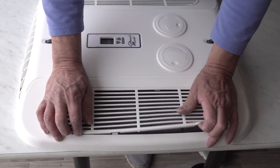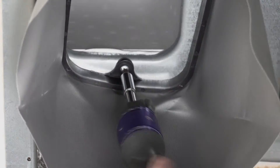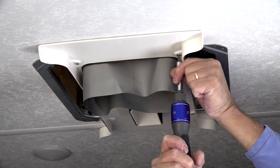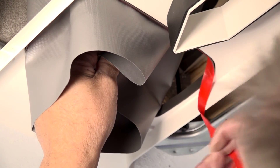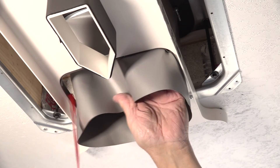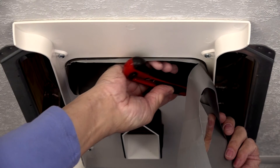Remove the grills and filters from the ceiling assembly shroud. Locate the cloth duct assembly and attach it to the rooftop unit base pan with three of the short screws. Raise the ceiling assembly chute to align with the cloth duct assembly, then attach the chute to the steel mount frame with four short screws. Expand and straighten the cloth duct through the ceiling assembly opening. Gently peel off the release liner of the VHB (very high bond) double-sided tape and press the cloth duct uniformly around the perimeter of the opening to adhere it to the plastic chute. Carefully trim the excess cloth duct — a razor knife is very effective for this step. Take care not to tear the fabric beyond the adhesive strip.